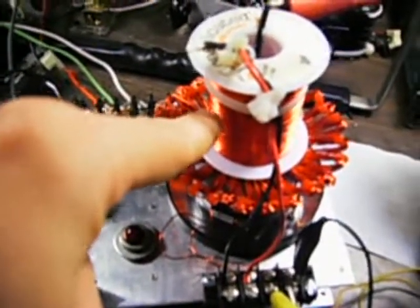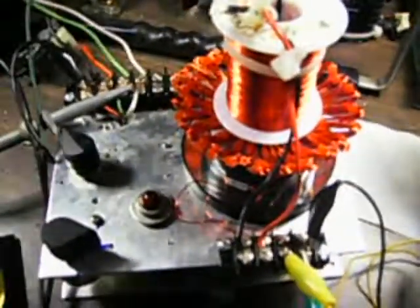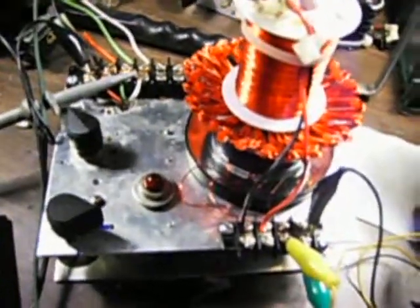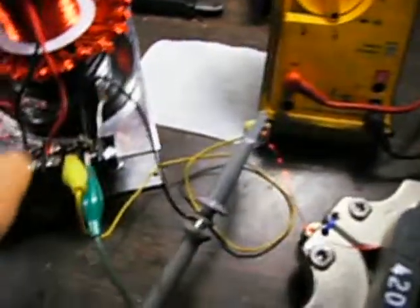The leads are tied together out of phase with our larger 26 gauge, 50 and change ohm generator coil up here. So that's creating a pretty odd flux field, and we're taking our output here off the 34. Okay.